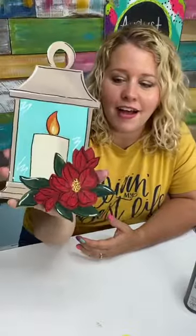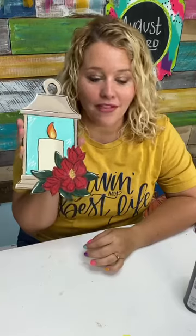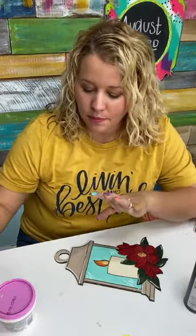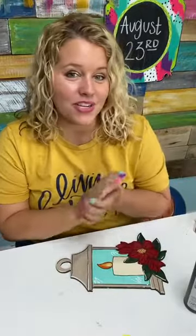The front is all patched up and fine — the back looks good as new. You can almost not even tell that we touched that up. So if you ever have a knot hole in your wood or you have a mishap and accidentally cut into an area that maybe you shouldn't have, wood filler is preferable, but as a good backup you can use drywall spackle — even some that's kind of dried out, because I just re-wet it with a little bit of water and made it work. I hope you guys have a great day and I can't wait to see you guys tonight in the workshop. I'll be live tomorrow morning at 9:30. See you later.